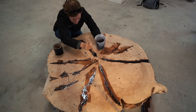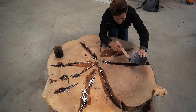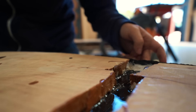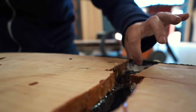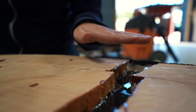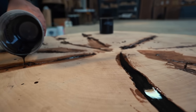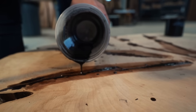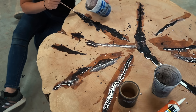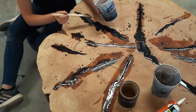After it's poured and cured, you'll be able to sand it to be exactly flush. This will make things look like a mess, but I promise it's all going right at this point. I ended up getting inventive again when it came to that big crack. This was going to be really tricky, so what I did is put a piece of foam here, tape it with some really heavy-duty tape, and then this is actually a bunch of caulking to keep it from rolling over. My goal is to fill this crack up first with epoxy, then I'll mess with this side later on. This trick came in handy because it has two show faces — the top surface as well as the edge face. I am definitely making this up as I go. After every pour, I would put a heat gun to pop any air bubbles created from the pour, then let it sit for a solid day after I got all the cracks filled.